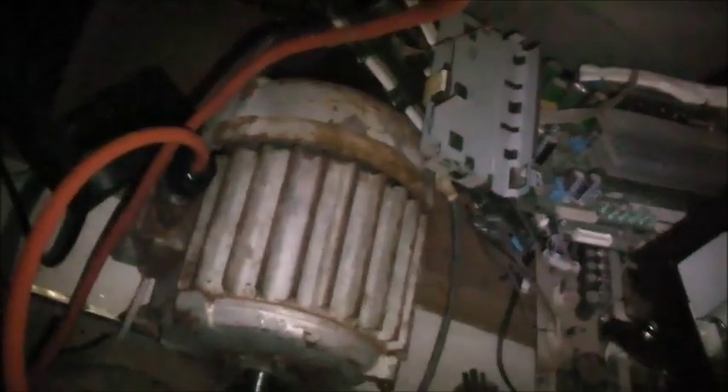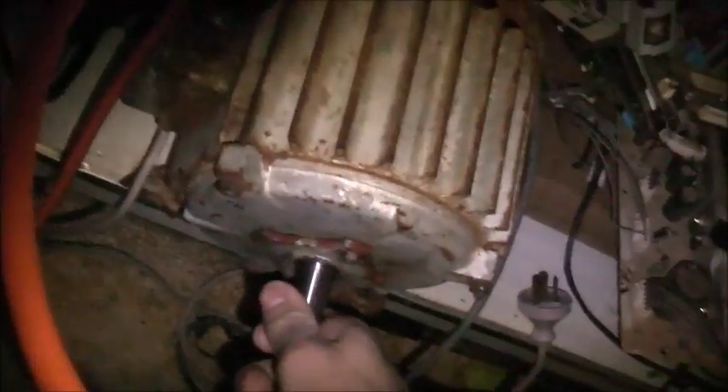A bit of torque but not enough. You see, I haven't got the voltage set high enough — it's too low. The torque's not so bad at the low end, it's just going to go faster. The torque's better there. I'll have to reconfigure this drive.